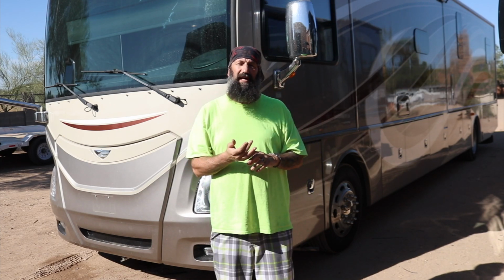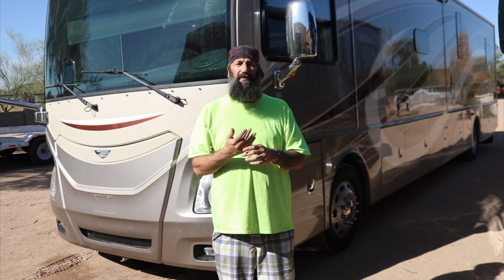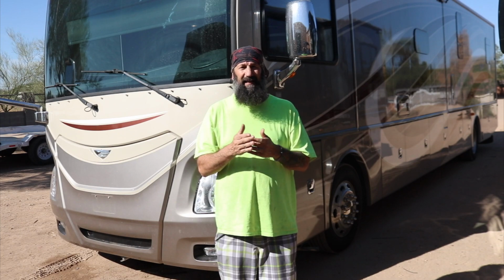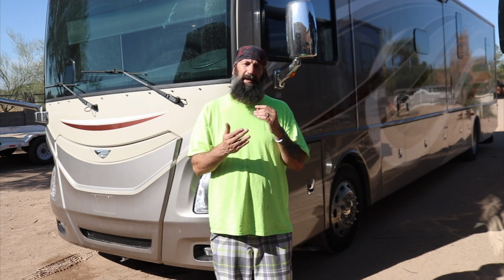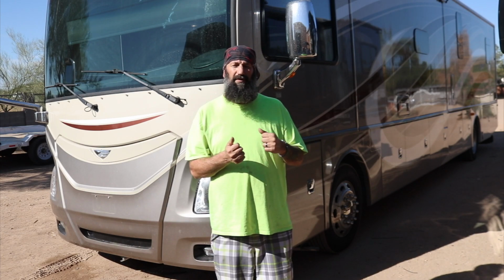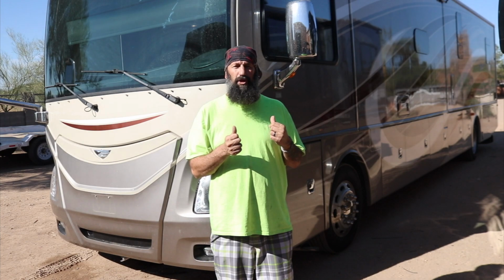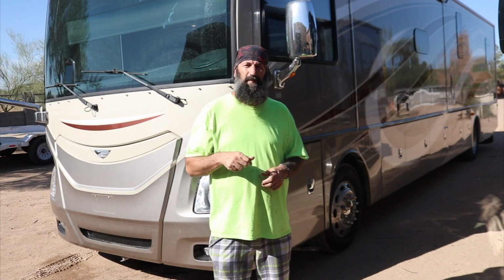So the system itself, he got 3 panels on the roof. The panels are huge. They're 325 watts each. They're Canadian something or another. I'm going to get the name of the company, and I'll put that in the description for you. He also has a MorningStar controller, MPPT, that was put in. There's a panel inside. We'll just take a quick look at that, and we'll take a look at the controller that's in the back, and that's a 60 amp. So let's go take a look at it and see what his setup looks like in the back.